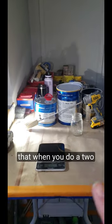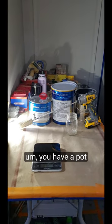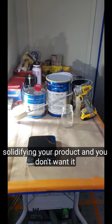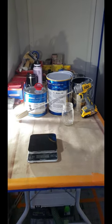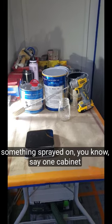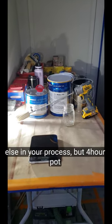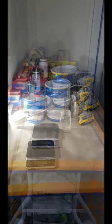What I will say is that when you do a two-component process, you have a pot life — meaning you need to use the paint by a certain period of time because the hardener will start solidifying your product, and you don't want it stuck sitting in your sprayer and messing up your expensive gear. But this stuff is a four-hour pot life. So if you can't get a coat of something sprayed on — say one cabinet set within four hours and then rinse your stuff out — we're going to have to talk about something else in your process. But four-hour pot life is pretty good.